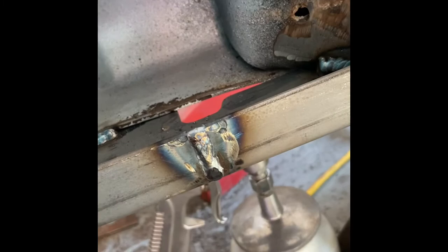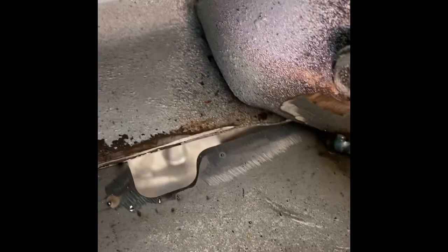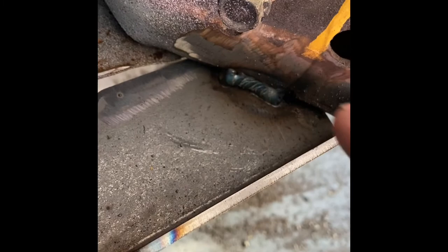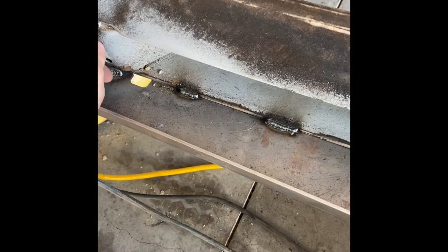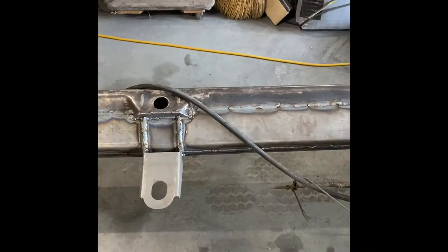That right there was a notch that Helwig had put in there so you can bend that thing around to close this gap up. Now that gap is closed up back in here and it follows the body line under there along the chassis itself. I'll fill that all in. I've got some tacks in there now and this thing is ready to go. Also, these factory brake line bolts are going to have to be relocated — they're not going to be able to stay there because you're going to close them in on both sides, so pull those out and relocate your brake lines somewhere else.